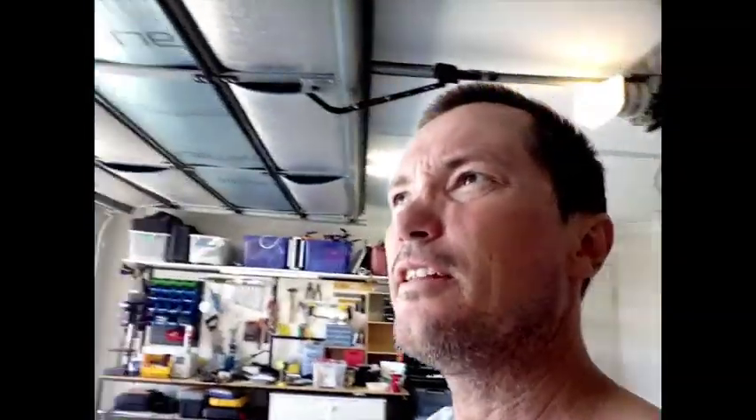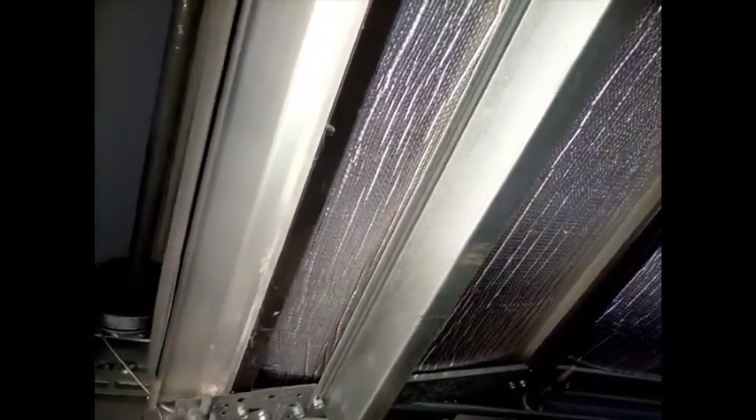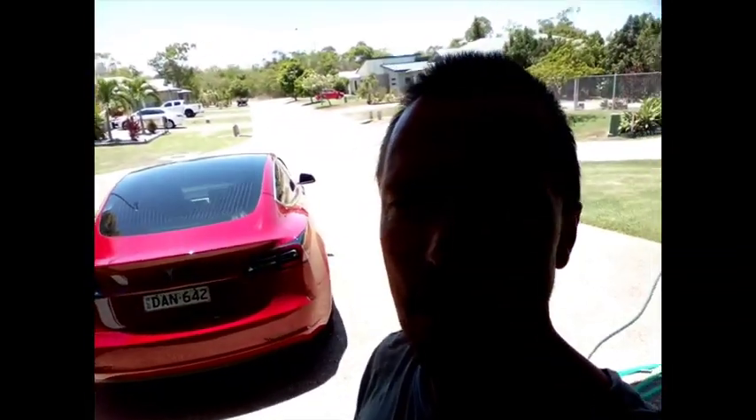Right, so we've got the cables in their spots. We were giving it a bit of this action and the cables are sitting in their drums quite well. We've just had to run it up and down a couple of times to get the lube to do its thing. Getting them to the same tension was a challenge — there seems to be a little bit of a difference there — but we're going to leave it and see how it plays out. So instead of waiting until the 14th for the Steel-Line garage door shop to open so we can put this precious Tesla away, we've fixed it ourselves.